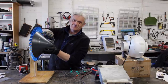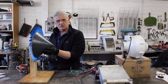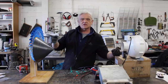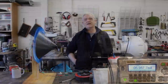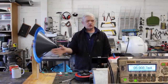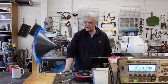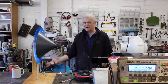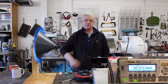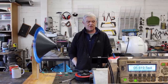So we're going to glue that cone on there. In theory, we should get the wind sweeping past and get a performance improvement from the effective blade area. I've tried to keep all variables the same: the same distance, same wind speed, same load — this little blinking LED set. The only change is the addition of this cone, and I'm recording the milliamp reading.